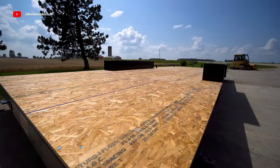So I just tacked the 2 side pieces in place with a couple of nails. For the top piece, both ends are cut with that exact same cut I just did, with the tab bent over and a 45 degree miter. Also, if it's not sitting quite flush on top of the window and has a little bit of an air gap, you can just trim down those side vertical pieces a little bit until that top piece of J-trim sits on there snug. Then I'd go around nailing in all that J-trim in about 1 foot increments.